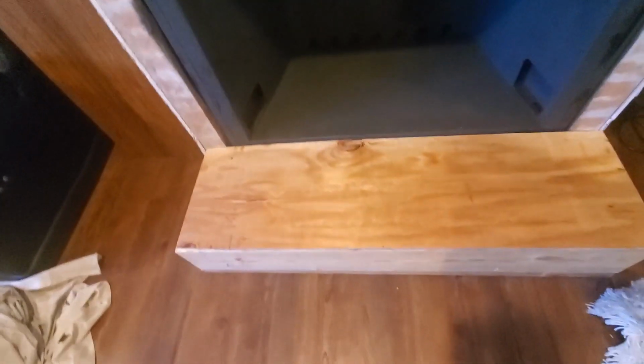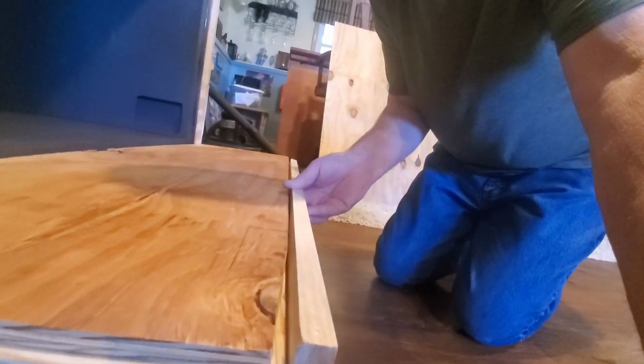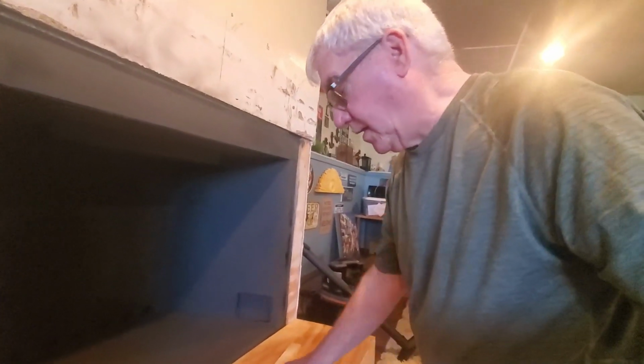And then we have bigger sheets that will go on top, and then on the sides I'm just using a board, and we haven't decided what kind of stain. And what will happen, I'll use this little piece as an example. You can see this board will represent a 12 inch piece, and I'll have to cut down. As you can see, there's a little lip over here, and so the tile will come right up to this board, and it'll be a nice trim.